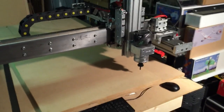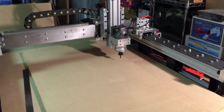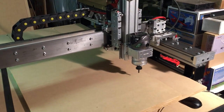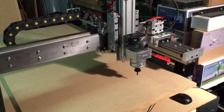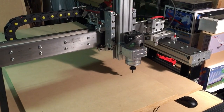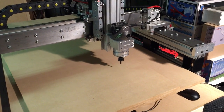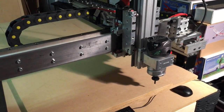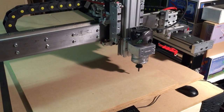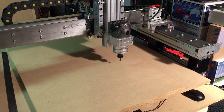That's 200 inches per minute — it doesn't look like much, but that's how fast I ran my flatbed printer when I cut foam airplanes. Of course, feed rates and all of that are completely dependent upon the material you're using, the substrate you're cutting, and the bit you're using. I can't ever imagine a situation where I'd want to cut any faster than what we're showing here. Foam is about the fastest I cut. This is almost four times the speed I would normally cut quadcopter frames.